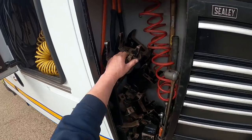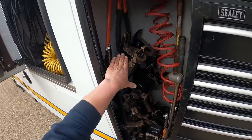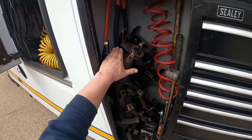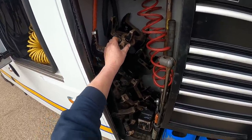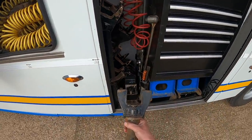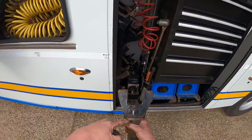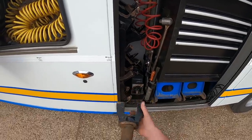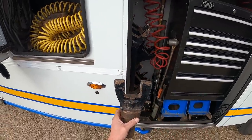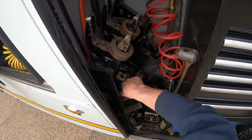We've got a lot of lifting forks in all different sizes. The main thing about these forks is when you put the axle on, it's got to sit right at the bottom of the fork - not up on the side, right at the bottom - and the height just keeps it from moving back and forth. We have these little collars to add a bit more height. For example, this is the ideal fork for a lot of DAF trucks, but DAFs are a little bit lower now with the new sump pans, so using these forks near the crosshead can be tight. This collar adds a little bit of height and it's surprising how much difference that makes - just gives you an extra few inches so you're not rubbing on the sump pan.